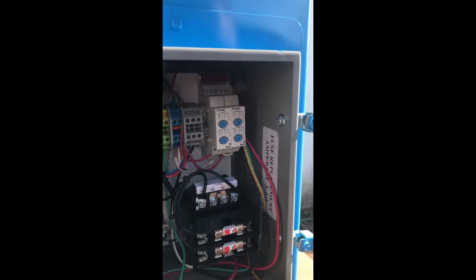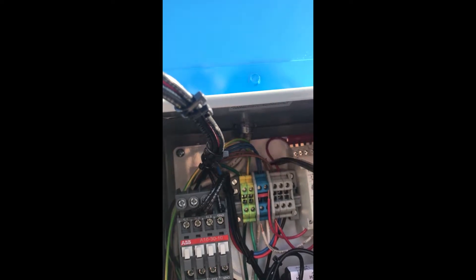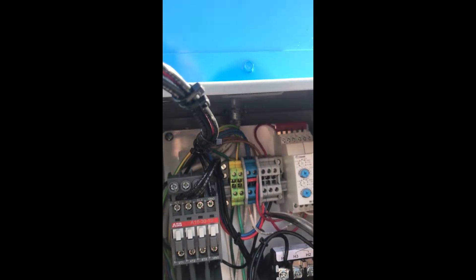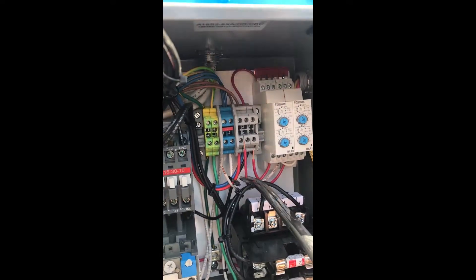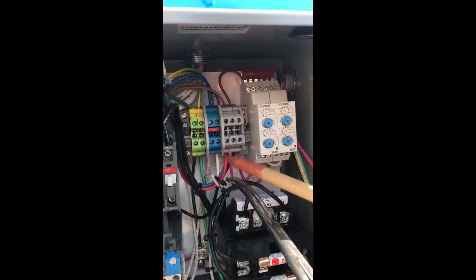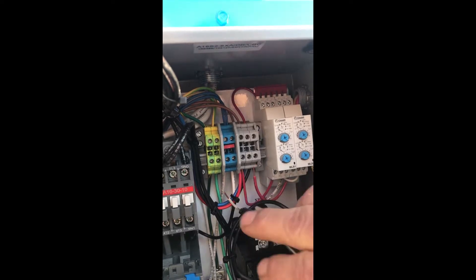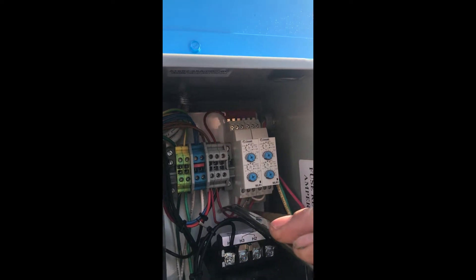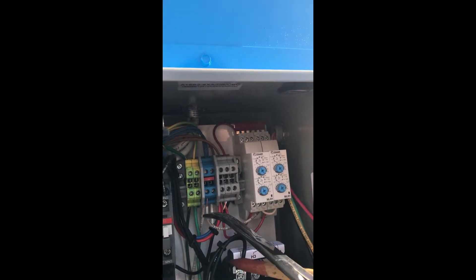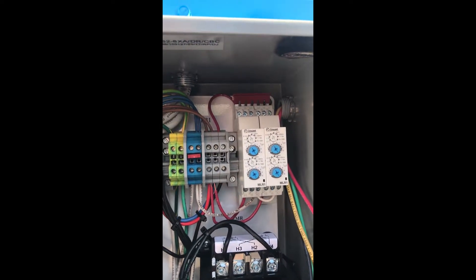It clips on that DIN rail there in the back. That red wire on top goes into that block and tightens up. That's an 18 right here — 18 gauge first wire goes into the first block right here. Your second 18 right here goes in the second block, and your white one goes into the blue block.